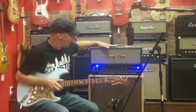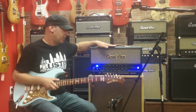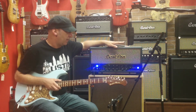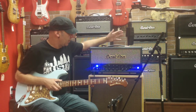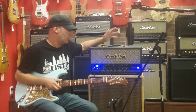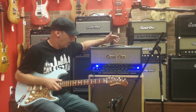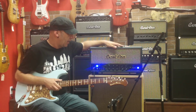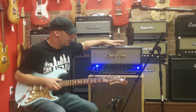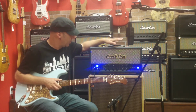This actual amplifier is a 100 watt version. This runs 4 EL34s. Because it has the automatic biasing system, it can also run 6L6s and KT77s and also KT88s, 6550s as well. With the big tubes like the 88s and the 6550s, they'll actually run around about 130 watts. So this one's quite a beast.